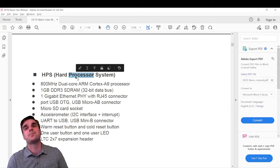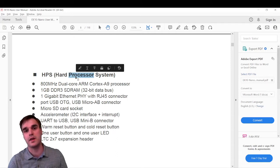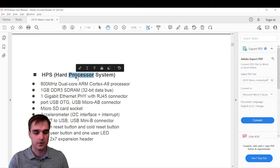There is an ADC on board that we should probably look at how to use. There's probably the Ethernet, the HDMI, all these things we're going to be looking into. And it makes sense to have both an FPGA with a microcontroller, because you can have your high-tech design on the FPGA, but it can be difficult to get that design connected to the internet. You'd have to basically have a soft IP core, or your own data path, and it's going to have to interface with some sort of Wi-Fi enabled board, and communicate probably using SPI or some sort of interface. But having that microcontroller to do that boilerplate work really helps out with getting our design actually on the internet.